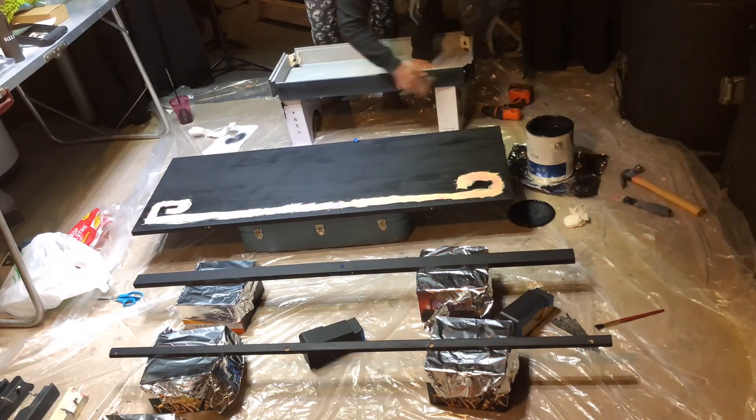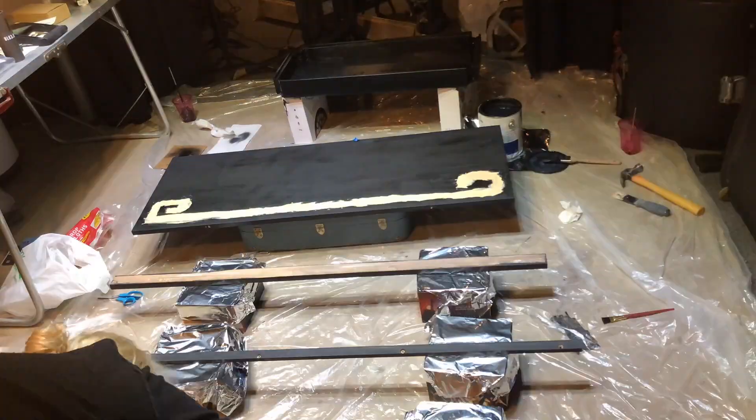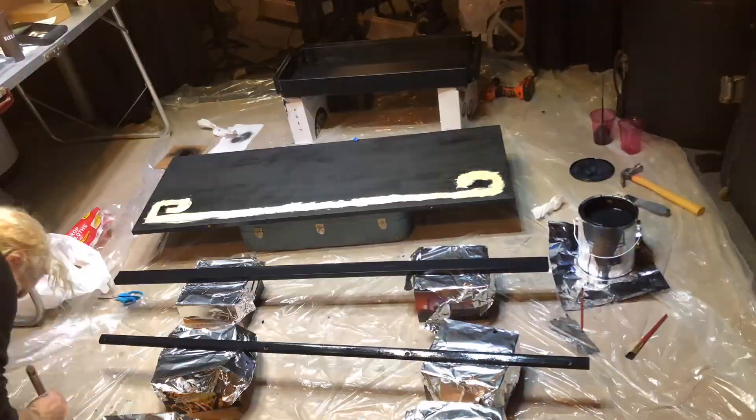The ridge on the kick panel is still visible, so I have to fill it again — that'll be the fifth layer of filler — but you can't see all of it, so I feel like it's working in theory. Everything else basically just needs a second or third coat. Inside the piano bench, I'm using black spray paint on the metal corner pieces, as this cabinet paint won't stick to metal. Everyone else gets another coat of paint.